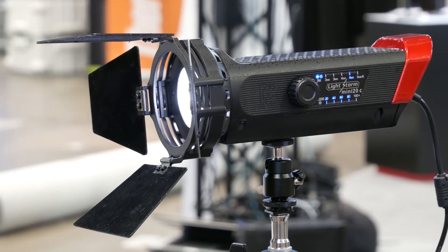This is kind of crazy because there aren't really any single-source bi-color lights, and if there are, they're really large. The reason is that chip-on-board designs usually have one big 3200K LED and one big 5500K LED that mix, giving you two fat shadows. What we do — and we're the first people to do this — is take one big daylight LED, cut out a circle in the middle of it, and put a 3200K LED inside. So it's like a donut ring with something inside. That still gives us a single-source shadow. And to make sure the light coming out is consistent, we have a silver mixing chamber inside where the light bounces around and comes out fully mixed, so the color temperature is all even.